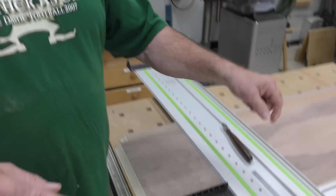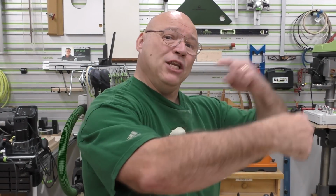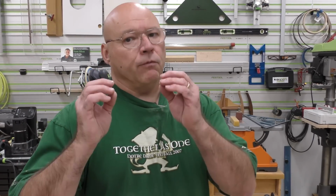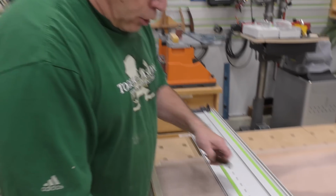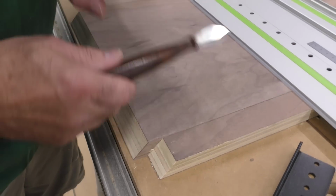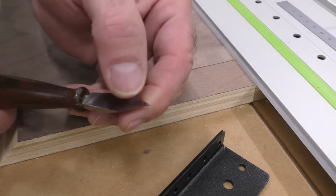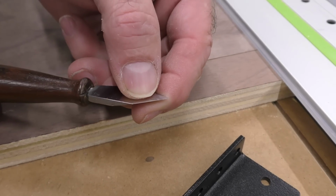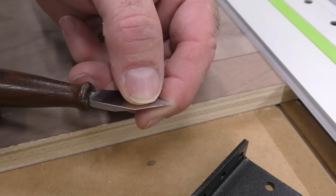This is tough because when I'm going to make a cut on the top, okay, so I can continue that grain. But the situation is I got to cut another one of these. I need extreme repeatability on this. So I could draw a pencil mark right here and align that long point there. But what I prefer is this will cut into my MDF, big deal, but it's a really great fine reference mark. And I'll show you how to do that.